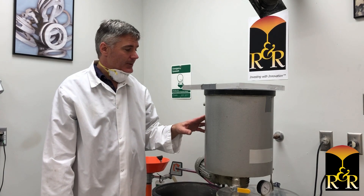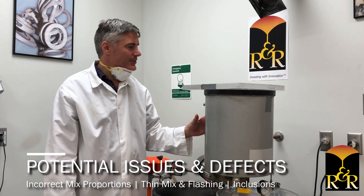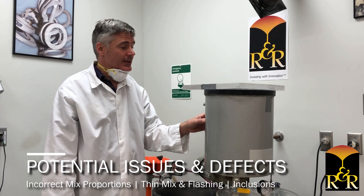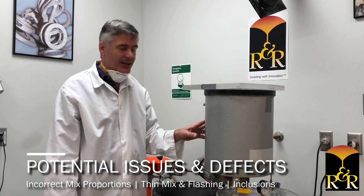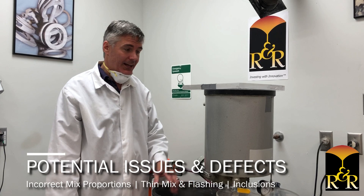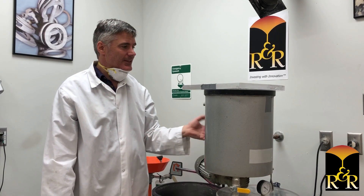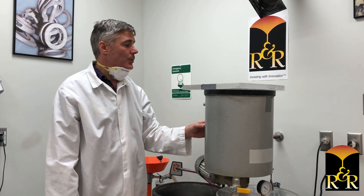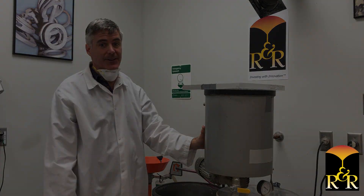So why do we do this? Well, you can have a couple of things go bad. One, your mix proportions are going to be off if you have too much caked in here, which could cause a really thin mix and other flashing issues. Another problem that can happen is inclusions, because you've got unmixed investment in with mixed investment and you never know where that's going to fall. So don't simply put everything in here, put the lid on and go - there's going to be a lot of unmixed investment hanging on the sides. We recommend stopping to scrape it all down before starting the mixer. Take your time because you've got eight minutes to do all this.